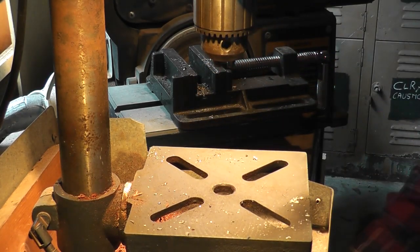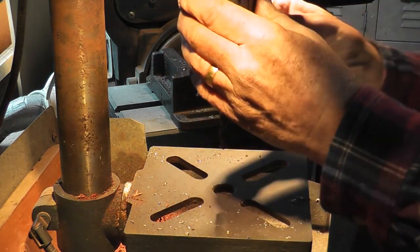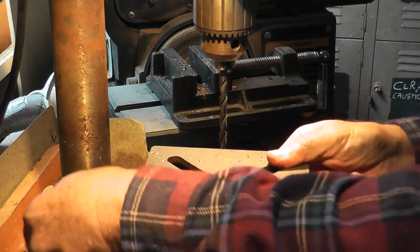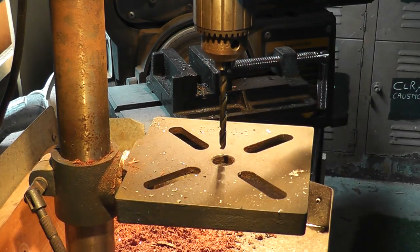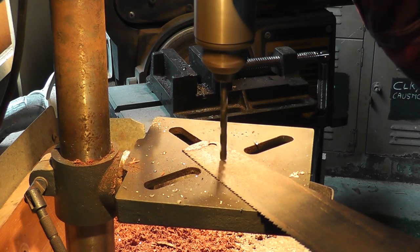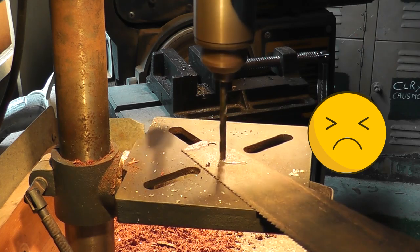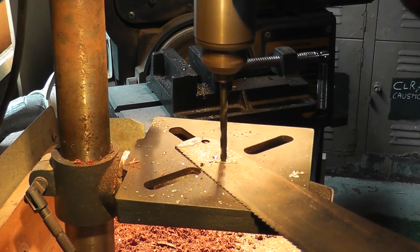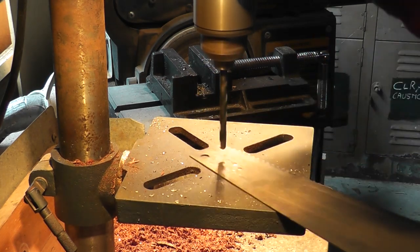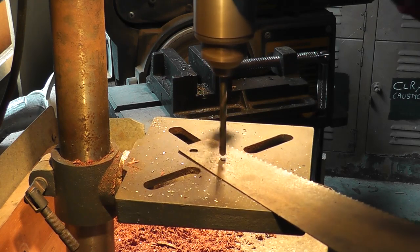So what I decided to try was — and I'll show you how hard this is to drill. Make sure it's in the centre. Tighten the chuck up, tighten all three just for a little bit of play — just works better. Make sure that's going to go through there. So I'm going to do it down here. So it gets part way through. I don't like the sound of that. If you flip it over, you can usually drill it from the other side. I don't like the sound of that at all.